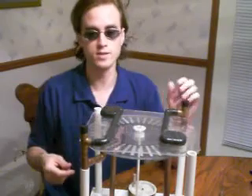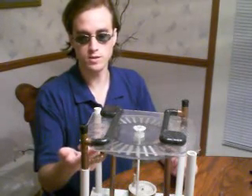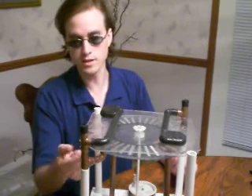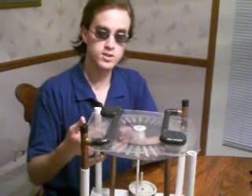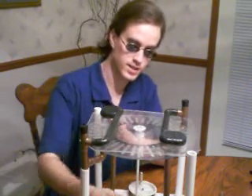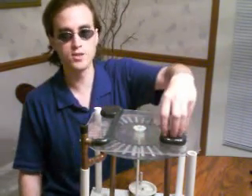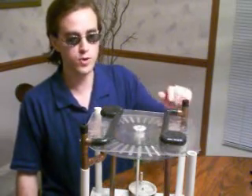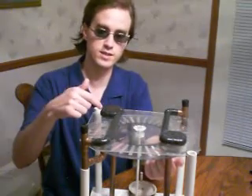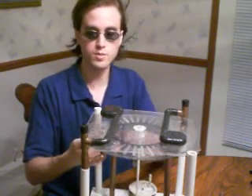This side could have zero and this side could have negative six. It really doesn't matter what the reference is. Since this side has more negative charge, it has more electrons. When one of these metal plates comes across, it touches a small piece of conductive tape, and as it rotates, it touches the neutralizer. Since it's connected underneath here, the electrons will be attracted to the other side, since it's trying to get to the positive side. And this is the negative electrons, since negative opposites attract. If this is three volts, then under here will be negative three volts. Since this is negative three, when this came around, that would be positive three.